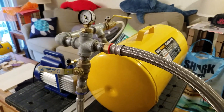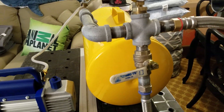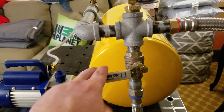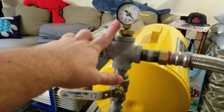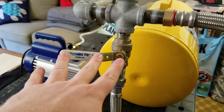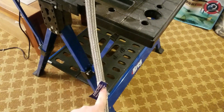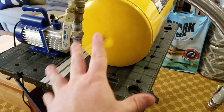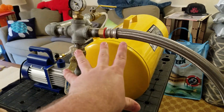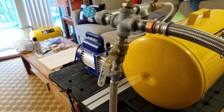Your plastic is heated up and you put it over the mold or the buck. You'll usually see me operate this main valve with my foot — at this point it's holding back all of your vacuum pressure. Once the plastic is settled over the buck, throw the switch. This valve connects to the bottom of your platen, and all the air stuck underneath the plastic will quickly be equalized by the system. At this point we have more vacuum than we have air, so the result is the plastic being pulled tightly around your buck.